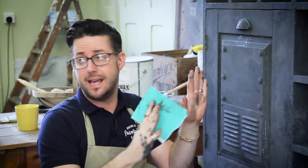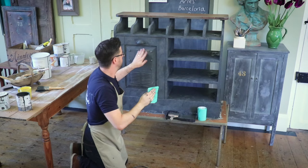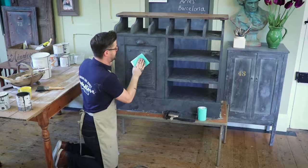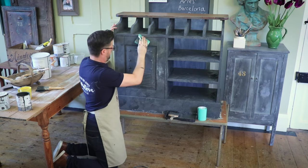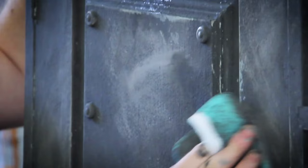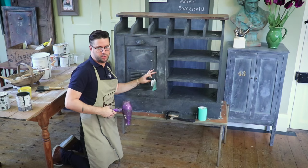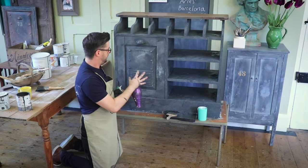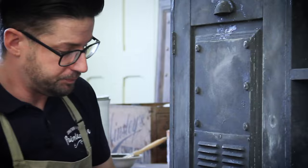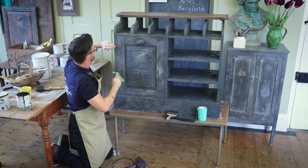I've been using the hairdryer to semi-dry this — it doesn't want to be completely dry. I'm going to take some sandpaper and just rub some areas off back to the duck egg. It's a good way of distressing when it's not quite fully dry — you'll pick up rough sort of patches along the edges. If there's anything you're not too sure about, you can go back with your paint and block it back out. But it's a good way of allowing this to be a bit more organic and let some of that duck egg from the original tone come through — adding a scrubbed, rubbed-out look on the edges.